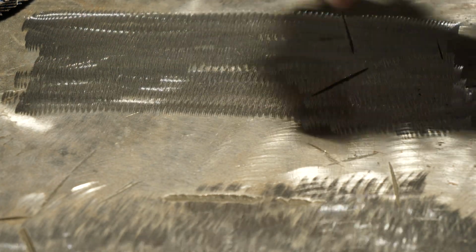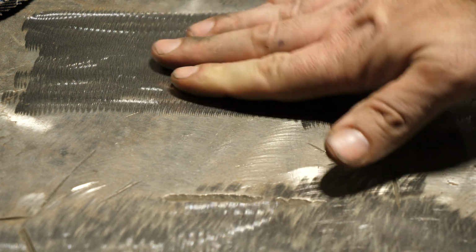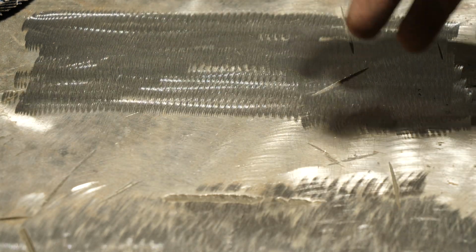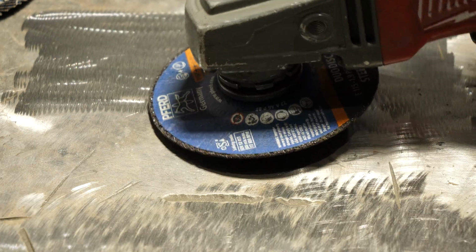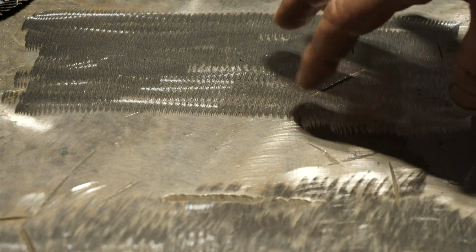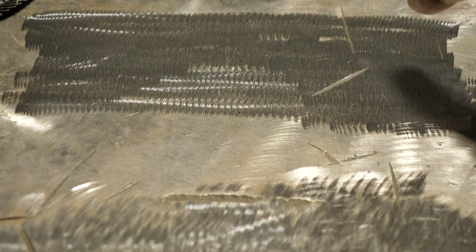I kind of was screwing around with it, testing it to see, but with that disc, you don't want to put so much force that you flex it, and you can't really lower it very close to flat to get a wider cut angle or amount of cut. Because if you look here, this right here hits, so it's not even touching, so you're limited on angle with that. So overall, I would say it works good, but I'd rather have the flap disc to clean this table off, since this being a ½ inch wide cut is just going to take far, far too long to do this table. So let's move on to the last one.